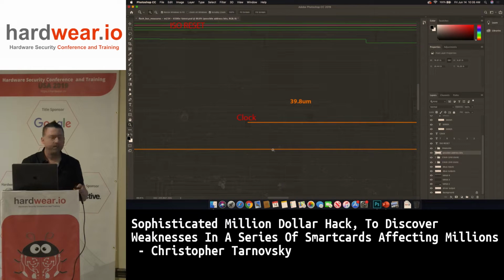And here's a clock. I need a clock. I've gotta get a clock, because even if I cut the flash outputs, this chip runs at like 25 megahertz or something internally. So I need a clock signal from inside. And because it's running in what I call linear code extraction, where it's sequentially walking through time, almost any line will work. Even an address line like A0 would work, because A0 is going 1, 0, 1, 0, 1, 0. That's a clock. That's perfect. So with 2 needles, I can read this chip out once I do my FIB edits.